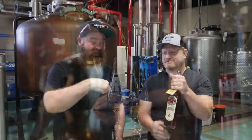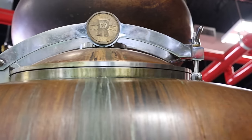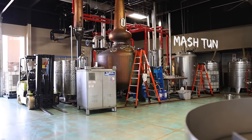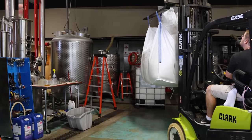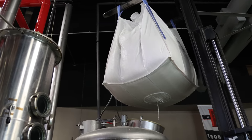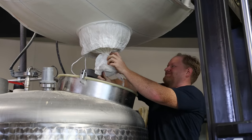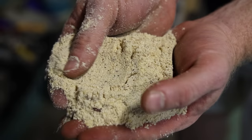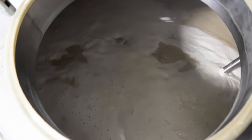Today Jonathan is going to show us mashing corn on a proper scale. That's about a 500-gallon mash tank, about 2,000 liters — we'll use this for everything we make here. We generally use about 400 gallons of water, heat that up to about 60°C / 140°F, then go grain-in. We have a fairly fine grist — not quite flour but almost — and we distill on grain, so there's no lauter in the bottom of this tank.